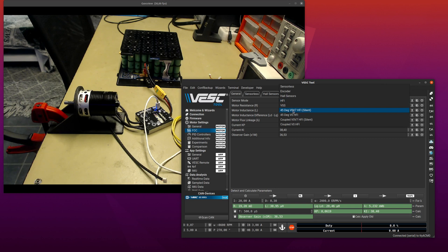The interesting thing with the 45-degree version is that it actually takes advantage of the saturation. If you pick your vector correctly and also pick the sign of the vector correctly, you can make it so that when you start to saturate the motor in the q-axis and get this misalignment, you're going to be pushed back to the right alignment.